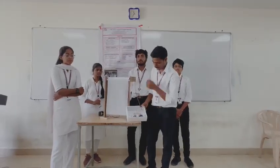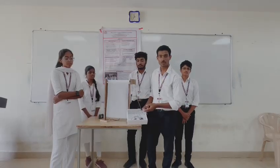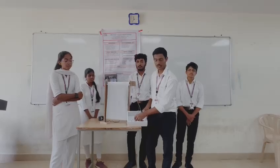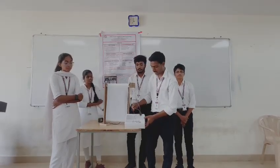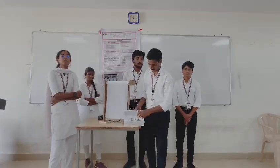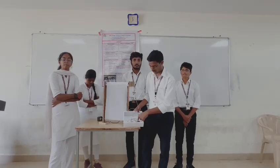For the motor driver, the input power can be given in two ways: either through an adapter or a 12-volt battery. If using an adapter, the positive is connected to one end of the adapter and the negative is connected to the other end, whereas the negative is also directly connected to the ground of the Arduino.